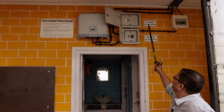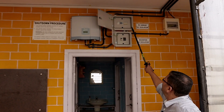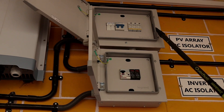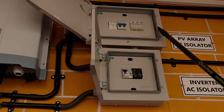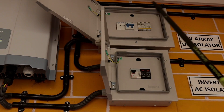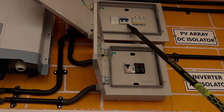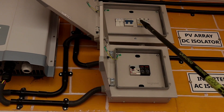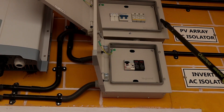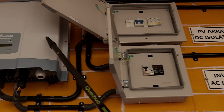The power output from the solar panel comes into this DC distribution box or array junction box. This is basically a single series system — all 10 panels are connected in series. There is a DC fuse, a DC surge protection device (SPD), which controls the surge from the solar panel and grounds it to earth. This is a DC MCB, and from here it is connected into the inverter.